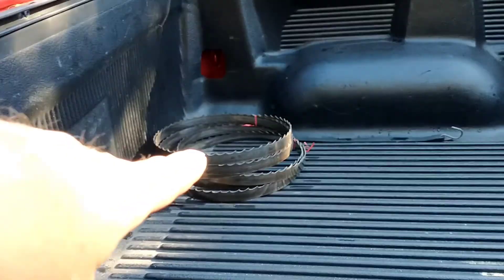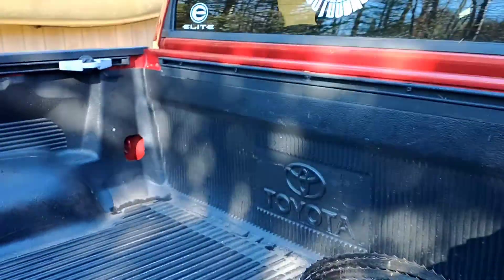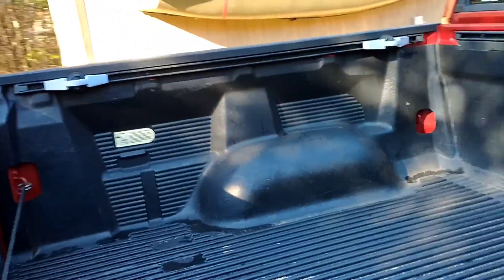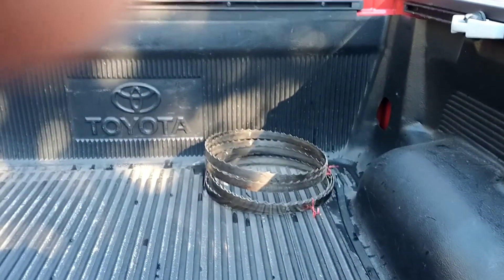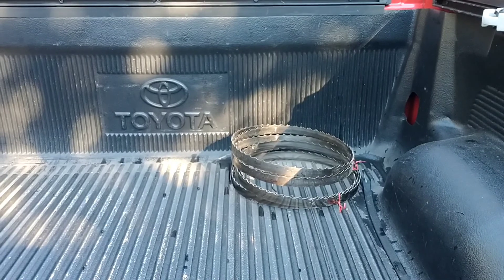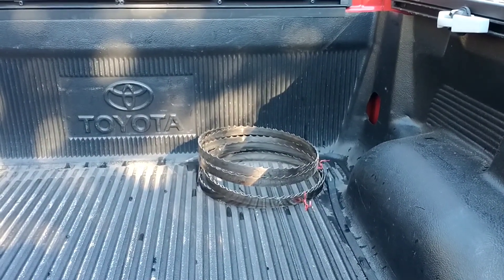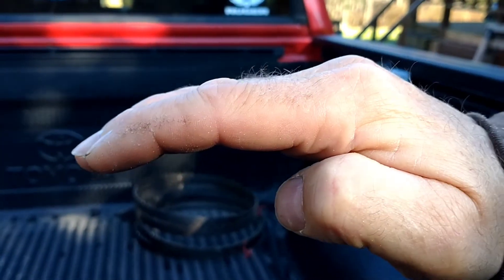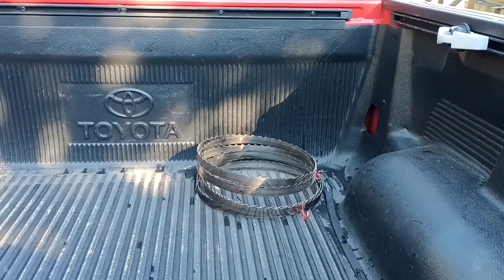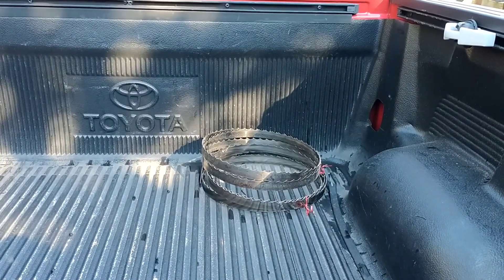The second thing we discovered — see these blades right here? Blades got hard to get with the pandemic, of course, like everything else. So Tim found this deal on eBay that said Wood-Mizer blades, five for ninety-nine dollars, so he bought a box. What happened is these blades are not Wood-Mizer — they're not stamped Wood-Mizer. It turns out they're very soft metal, and actually the blade itself cupped. If you looked at the blade going down, it was actually cupped like this. It couldn't cut a straight board if it had to. So we learned an important lesson: even though the ad said Wood-Mizer blades, they were not. They were some kind of knockoff blade, and believe me, they've caused more grief and ruined more logs.